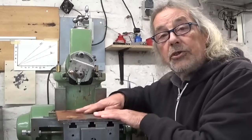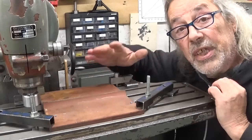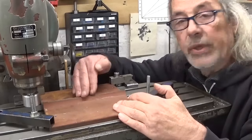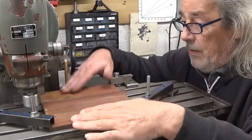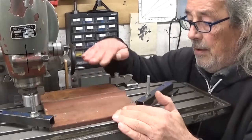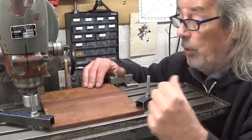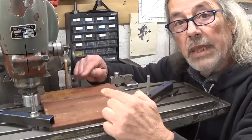So I'm gonna stop using the shaper and I will go and use the milling machine. Because here I can install my part held down just only on the 4 corners. Now this is the other plate, as you can see it's not cut yet. I installed it while shaping the other one, and this one has also a little twist in it, a tiny bit. So the plan is to leave the bow as is, and I will create here as big as possible flat surface, and on the other one too, and then bring my 2 parts together. Let's do this.